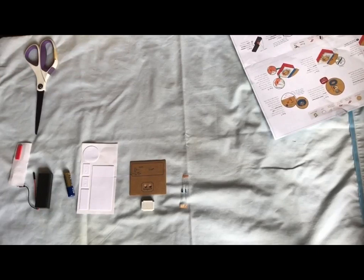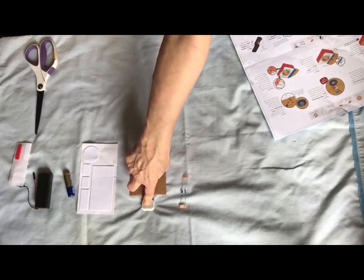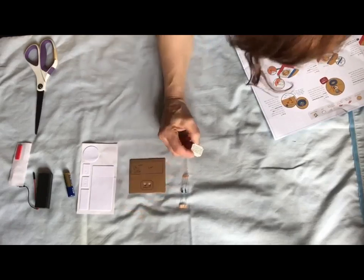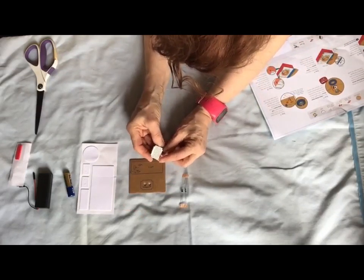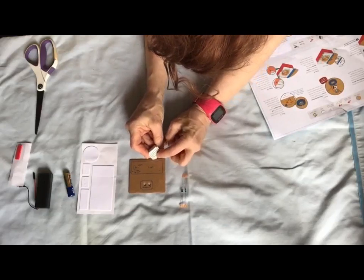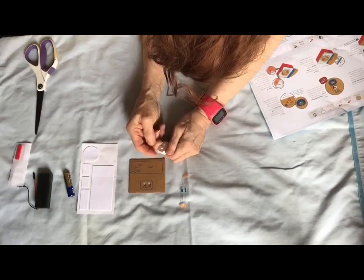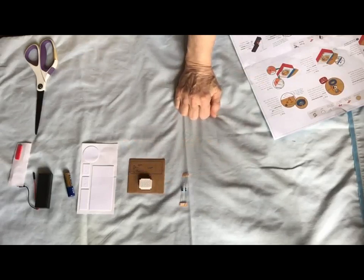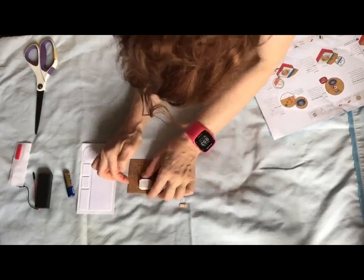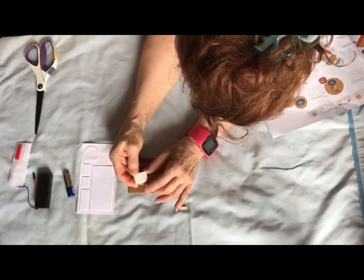Meet your breadboard. A breadboard helps you connect electronic components. See the numbers along the edge. This is pretty hard to see. There's 1 through 7 on one of the edges. You can definitely feel it, but it's only on one of the long edges. Looks like a little Lego. Okay. So if you stick something into a hole in line one, that means anything that you stick in line one, those are connected to each other.